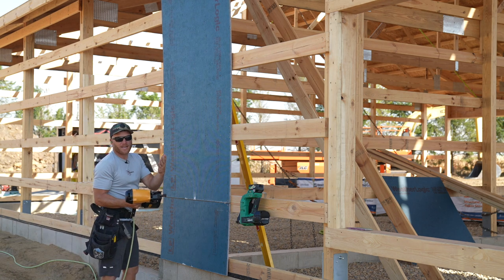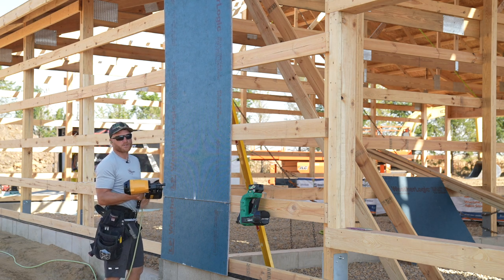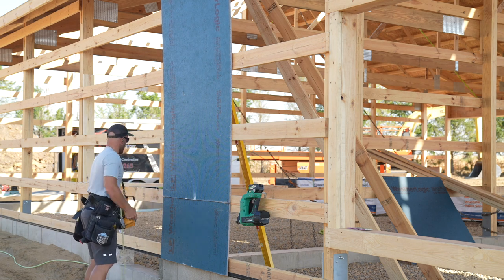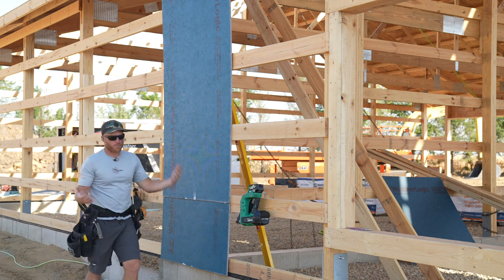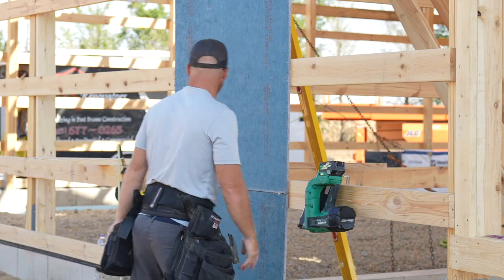2 3/8 by 0.113, basically an 8 penny nail, fully ring shanked, exterior galvanized, and we'll hit all this off, make it 100% fastened. But this is just to keep going. I don't like to have the background noise and the needless running of a compressor when I don't exactly need it. I think a lot of you might appreciate that because now you don't have that noise in the background.